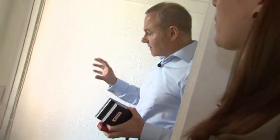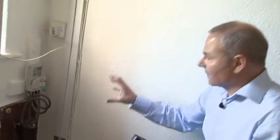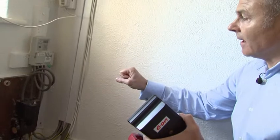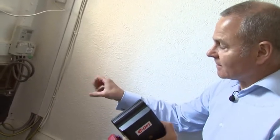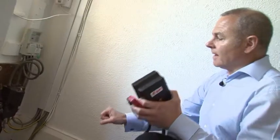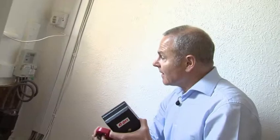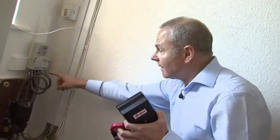You've cleared out the meter cupboard — that's made access really easy. Now the first thing to do before you fit one of these is to take a visual check of your meter box. What we're looking for are signs of any burning, signs of any water, or signs of any loose wires — and that actually looks fine. So what we've got here is the feed coming in, a fuse box feeding through to your meter and then out to your home supply. What we want you to do is fit this clamp around the live feed into the meter, signified by that red tie clip just there.